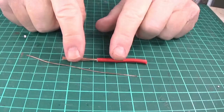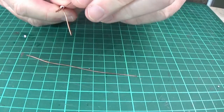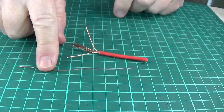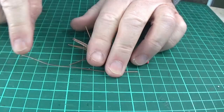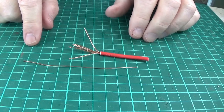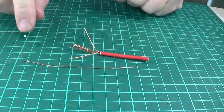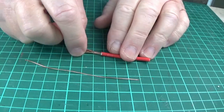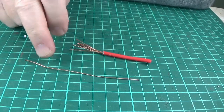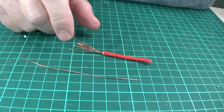I'm also using some standard electrical wire, this electrical cable for 240 volts, and this is about 0.5 of a millimeter, so it's a tad thinner than the other one, but it's also very easy to use, to wind in a jig and all that sort of thing, and easy to manipulate. So a bit of a concession there in the size. However, this is entirely practical. So if you can find wires that are around this sort of size and grade, that'll be fine.